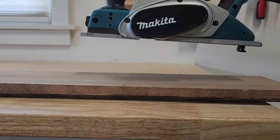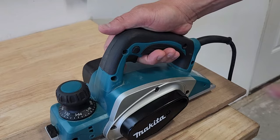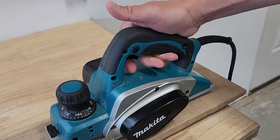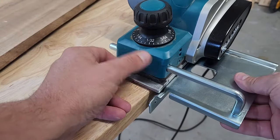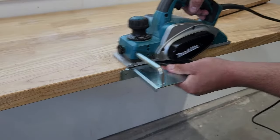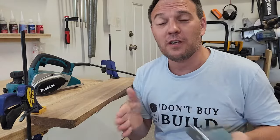That spring-loaded kickstand is a really cool little feature, but it's still always a great idea to make sure the blades stop spinning before you set your planer back down. On this hand planer, the power trigger is located right here and it's actuated like this. This button above it is not a safety switch — it's actually a lock for the trigger to reduce hand fatigue. Most electric hand planers will also come with an edge fence. On this unit, the edge fence just slides into this hole and can be tightened down with this adjustment knob. This fence is fantastic for when you're trying to stabilize a cut on a narrow board. The edge fence can also be used to make long rabbet cuts, and these little holes are so you can attach a board to it for even more stability.